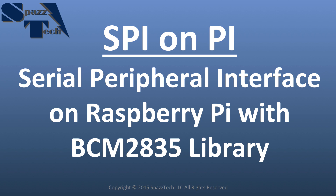We're also going to be making use of the BCM2835 library. That's a library we used before in our Blinky LED program. We also used it in our example for reading a GPIO with push buttons. So it's a library we used before, but in this case we're going to be using it to implement the Serial Peripheral Interface.